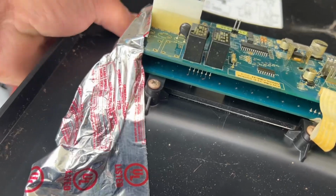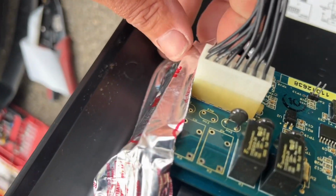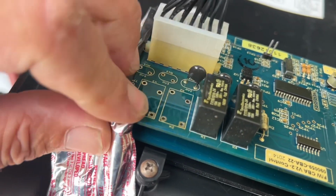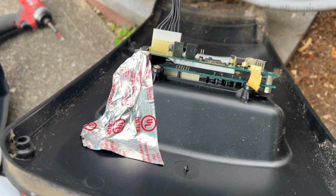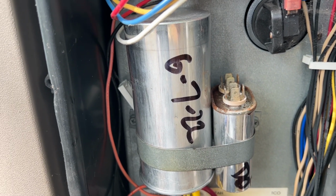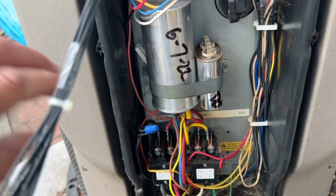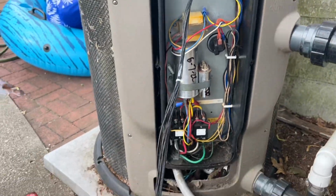All right, I just used a piece of mastic tape because it's gummed on one side. I'm not worried about it shorting out anything. Just gonna protect that a little bit. Make sure it doesn't hit any of those connectors. So I got a piece of mastic tape here to hold on the control board. And I put a date on the dual capacitor that we installed, and I got kind of lazy. I guess I could have got a new piece of band iron here, but I just put the old capacitor in there and got the new capacitor in there, and I wrote DOA there and today's date on the new one. And now we're gonna put her back together.